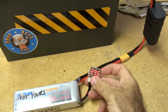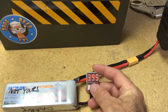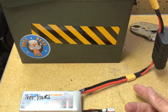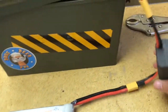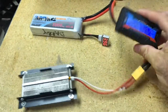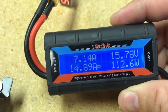Pretty soon she'll get down to say 3.7 volts under load, which is going to work out to about 3.8–3.9 — close enough to storage state. Now watch: when I plugged it in it started at 11 amps and it's already gone down to seven — and that's hot already.